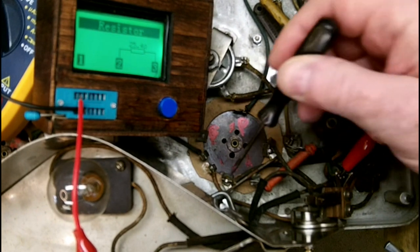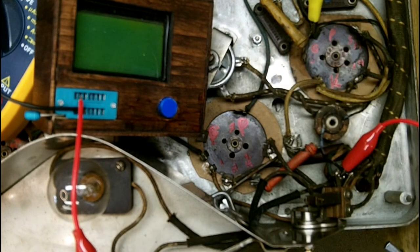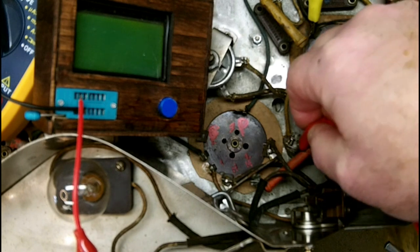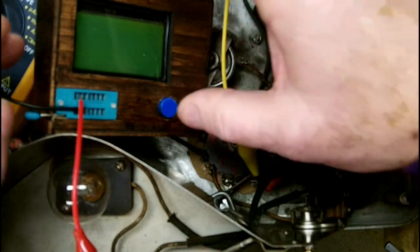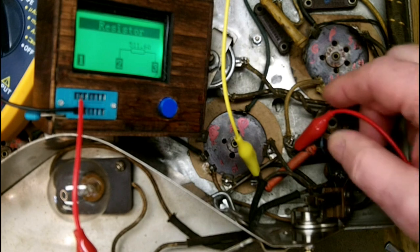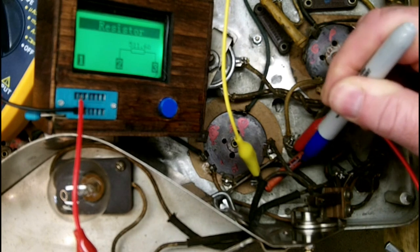This is the R3 — and if you can make out this strip down here, this is a flat wire-wound resistor. We're going to go ahead and hook up and check it. I believe R3 should be 400 ohms. Let's see what we get — 511 ohms. So that one's a little bit high at 511; it's supposed to be 400, so it's about 25-30% off. I may have to replace that one. I'm going to put a mark on it so I know I probably want to replace this.